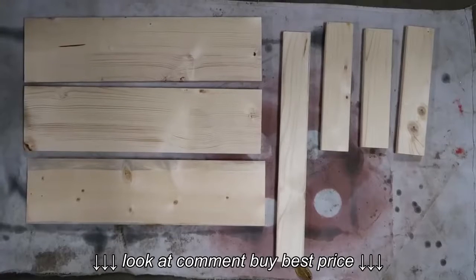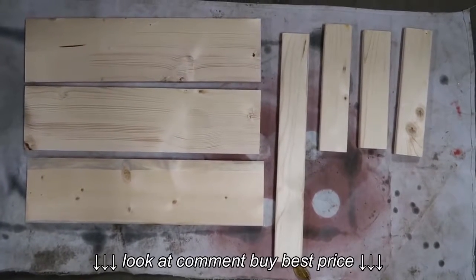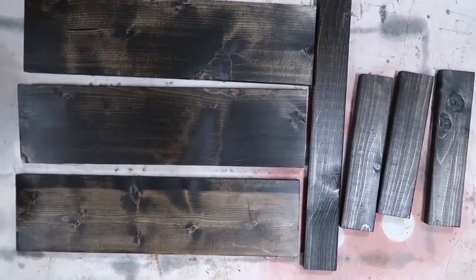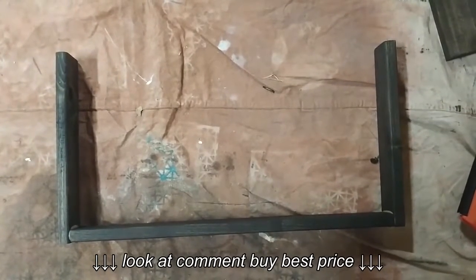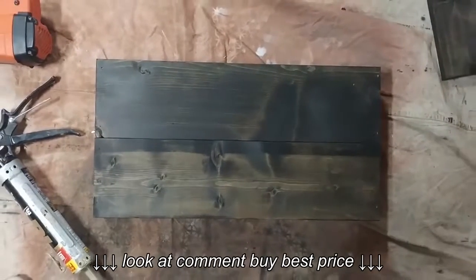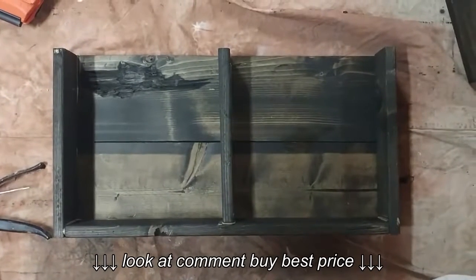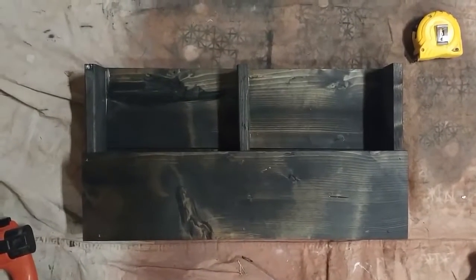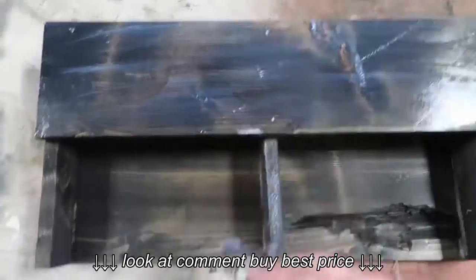Next I made the organizer. I have three 18-inch pieces of one-by-six, one 16.5-inch piece of one-by-three, and three 6-inch pieces of one-by-three — I'll leave those measurements in the description box below. Here are quick process shots of how I built this — again using PL construction glue and nails to put everything together.